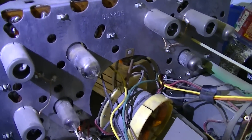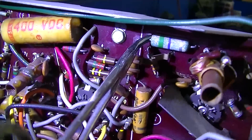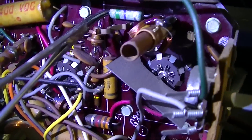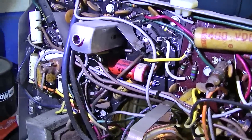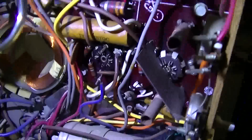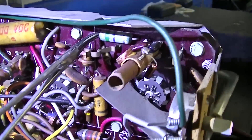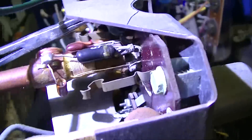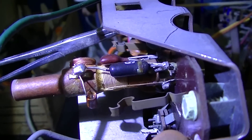This is the chassis out of one of my GE versions of this Hotpoint set. I'm going to pull this inductor out — it measures 11 ohms in circuit. Something else I noticed: you can see this is all original — all the original wax and electrolytics, everything is original. I'll also measure the diode in this one. This set is slightly different.